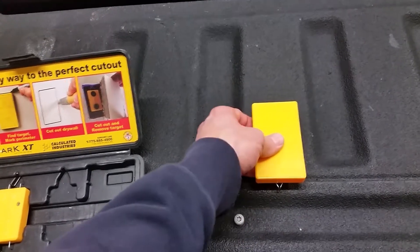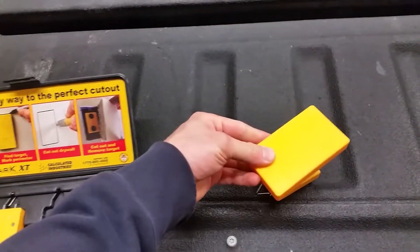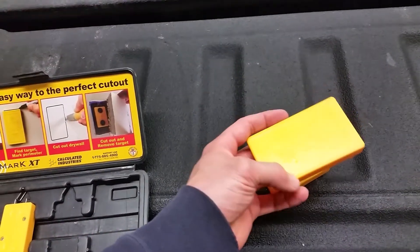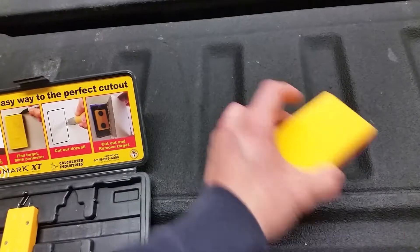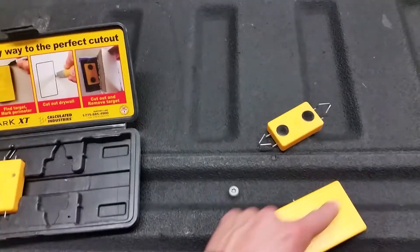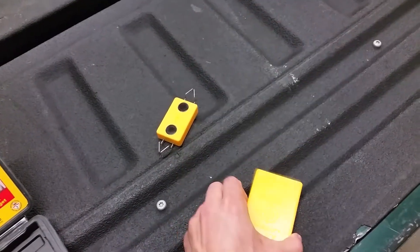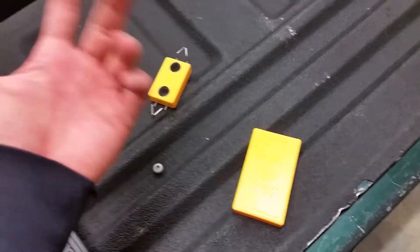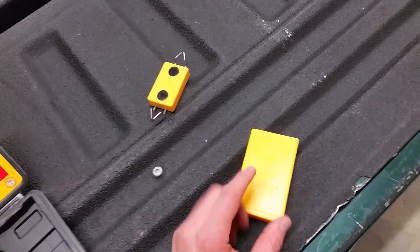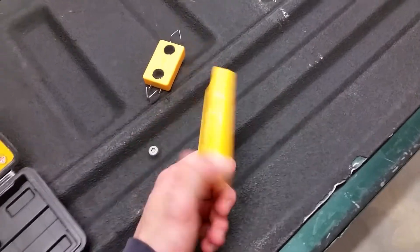What I would do is come down with the magnet, let it flop onto the surface and lock in, then trace around it. Take it off, slide it up, lock on again, trace around it, then come from the left and do the same, then from the right. After that you have a really good average of lines traced around it. Even if you don't get it perfectly positioned each time, you're going to be fine — it keeps tolerances really tight around whatever material you're cutting.